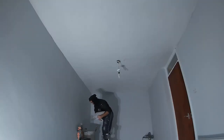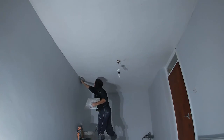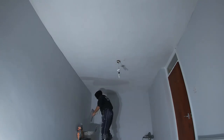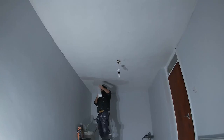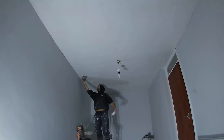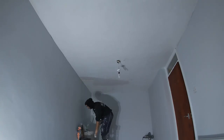My PVA's tacky, my mixer's ready and I'm just getting it all on there. I do find this make good plaster very very nice to work with the hawk and trowel — I've said that from the start. There's room for improvement on it and I know a lot of guys really detest the make good plaster, but I find the more you use anything the better you get. I do prefer Carlite and multi-skim to make good plaster, so I'll always go for them first, but fingers crossed make good keep on going and keep trying to make their products better and better.